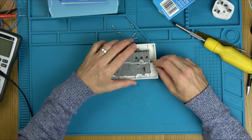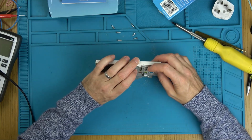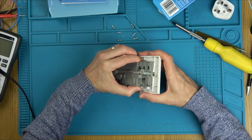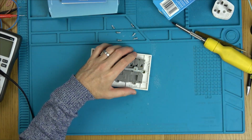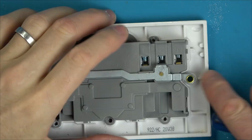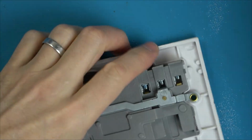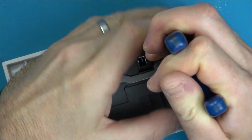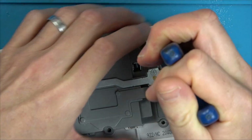I wonder, is there a way I can crush it, which would then allow me to maybe lift it off the thing? So that's what I do. I crush it with pliers, and bit by bit I crush the inside of the rivet to allow it to pop out. I should, in theory, be able to put it back through and then stretch out the bit that I crushed to make it into a rivet again.